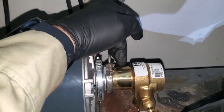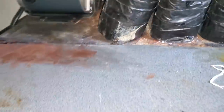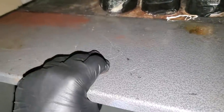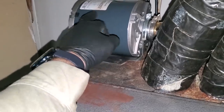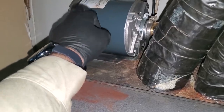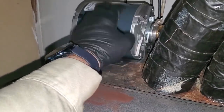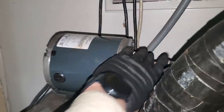It's running and it's already getting frosty after just two seconds, so we've got to insulate it fast. Nice and cold, pumps running, all looks well. I am going to tell them they need to get someone out here to clean this glycol — that's not my thing. It's very silty, and when I was moving things around it got completely cloudy. One would think that's possibly the reason why this pump failed so fast, since the previous pump was installed in September of 2019 and here we are in March of 2020 — that's not very long for one of these pumps.